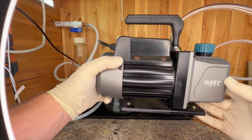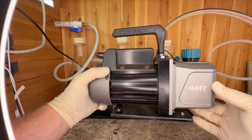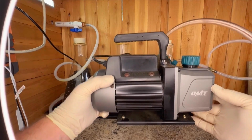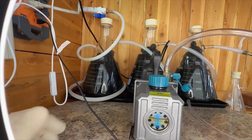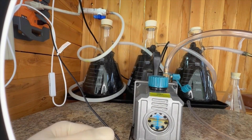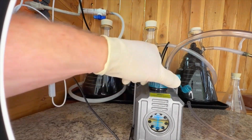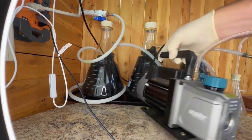The second component of my scrubber is the vacuum. I use a vacuum pump versus a water pump — it's just a basic three-and-a-half cubic foot per minute oil-based vacuum pump. The maintenance it really needs is just monitoring the oil as it discolors and gets more amber. Dump it out, put new oil in, and it's been chugging along with proper maintenance without any real problems.